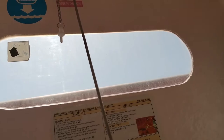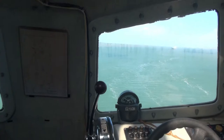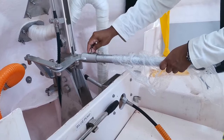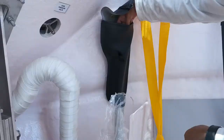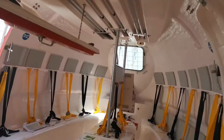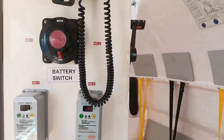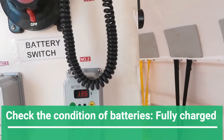Front and rear glasses should be free of cracks — there should not be any sign of damage. Especially in the case of free-fall lifeboats, these glasses are often seen damaged due to exposure to soot. The tiller should be tried out and emergency steering should be in working condition. Check the condition of the hatchets — no sign of damage. Boat hooks and oars should be in place. The condition of the battery should be checked; it should be charged and ready for emergency.